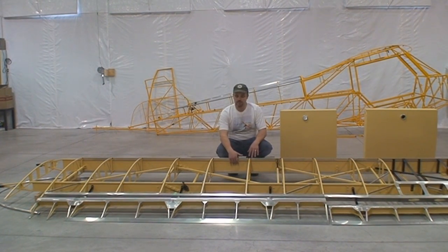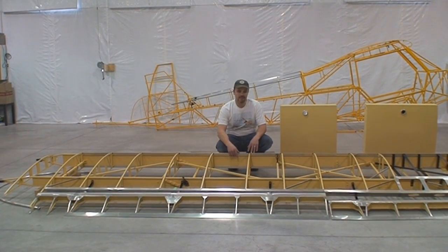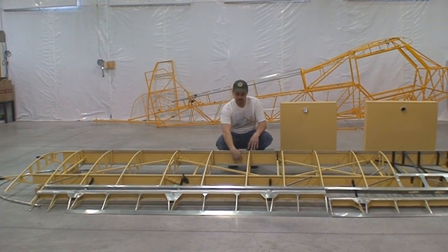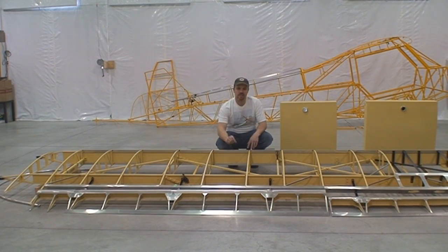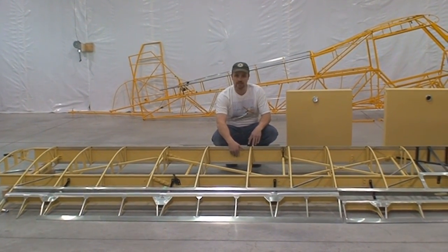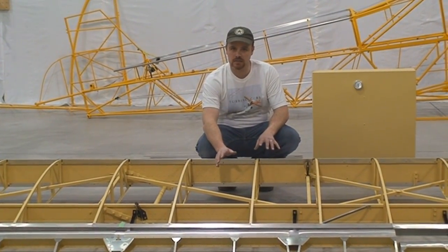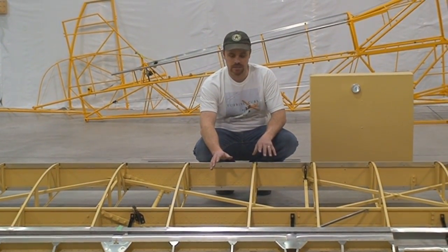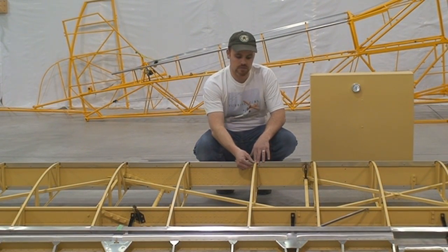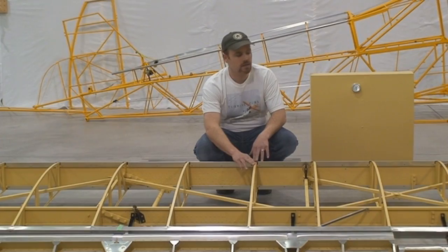We've got quite a few differences from original Pipers. Our spars, front and rear, we actually extrude ourselves. The outside dimensions of the spar are the same, but the web, which is the thickness in here, is 11 thou thicker than original Piper. These are all done from virgin 6061 T6 aluminum spars. Everything we use in our wings is good quality aircraft grade materials. We also, as I said before, extrude this outside rib profile.